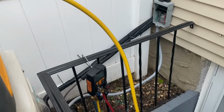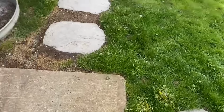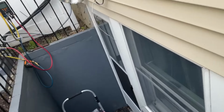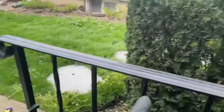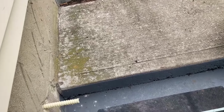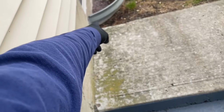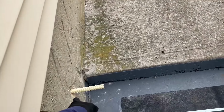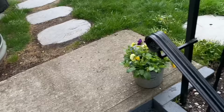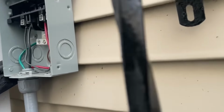All right. Now we gotta wire the line voltage. So let me go back on the edge. Oh, Godzilla, you know what you could do? I think you can handle this. We're gonna take a piece of 3/4 PVC. We're going to see if this will go inside the PVC, and we're going to run the PVC over there to the dirt, so when this thing condenses, it's not dripping down the stairs and doesn't look nice. That's what you'll do, and I will connect line voltage from here.